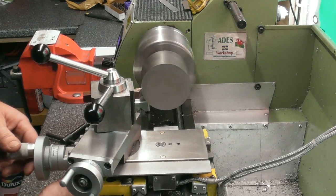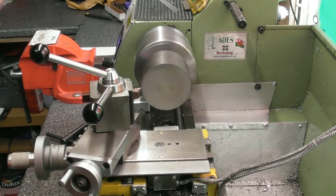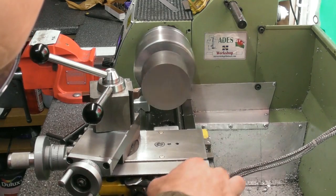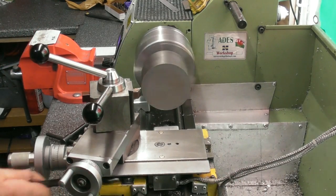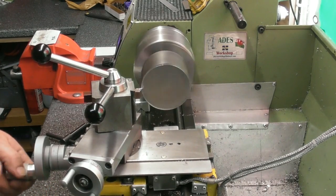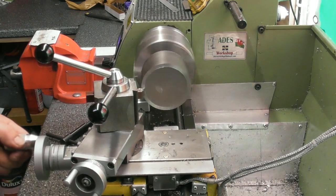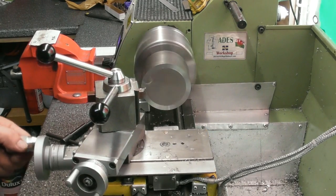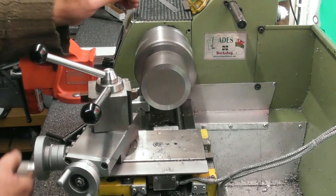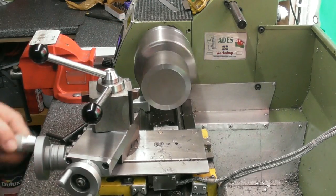Let's just do a touch off. Whoops. So I'll throw my spanner and then I'll lock the carriage. Carriage lock. Let's have a crack at this and see what it machines like. I'm doing 535 RPM and I'm just tickling it across the surface. I know it hasn't cleaned up yet, but that seems to machine quite nicely. Right, carry on.